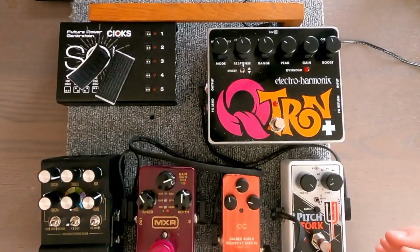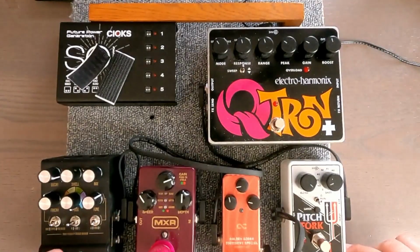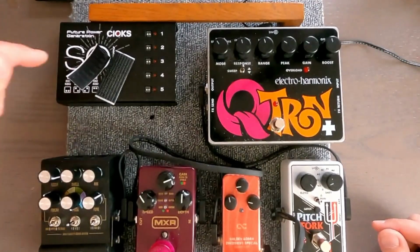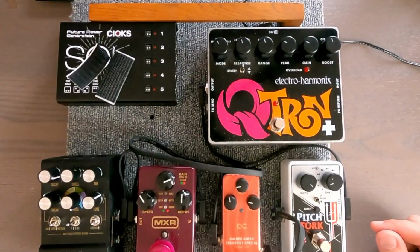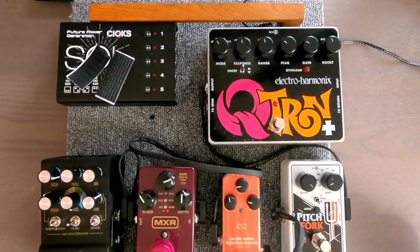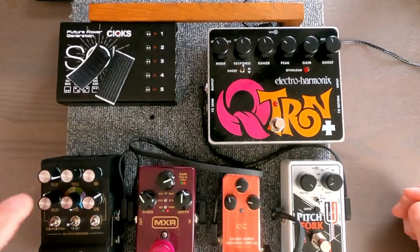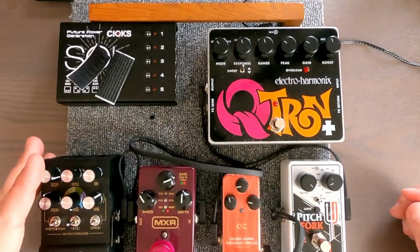But for the other 4, the main problem here is the Mako series reverb, because that one requires more milliamps than the previous power supply I had could deliver. However, this one by far delivers enough milliamps for the reverb to be fully functional. You might get some strange behaviors, errors, pedals that do not want to run correctly or make noises or anything like that. Of course you need to have the correct polarity, but if the milliamps isn't enough, then you'll be having a pedal that isn't behaving as it should be.